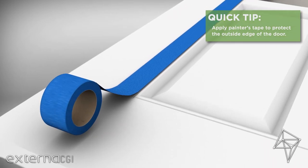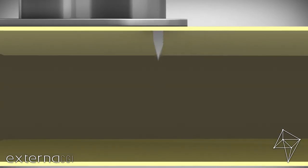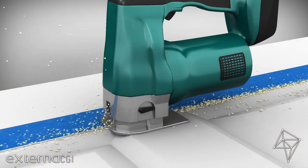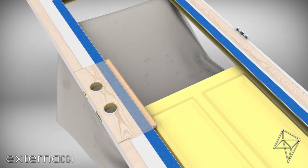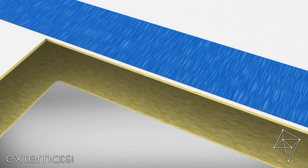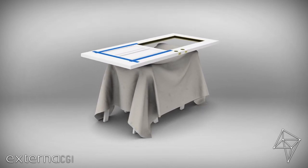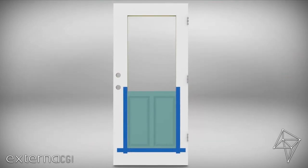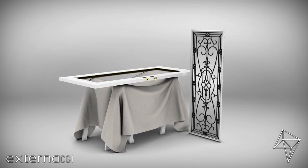Now you're ready to cut the door glass opening. Determine the proper blade size for your jigsaw — the saw blade should not protrude at its downstroke and should not come out of the door during its upstroke. Insert the jigsaw with a short-stroke blade into the inner core of the door and cut along marked guide lines from corner to corner. Because you'll be cutting through a material of different density near the lock, you will feel slightly more resistance. The newly cut edges are sharp, so be sure to wear gloves. Carefully flip the door over and repeat the same steps, making sure your cut lines are the same distance from the edge of the door. Next, remove all tape and debris as well as the cutout portion of the door.